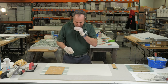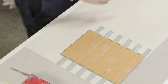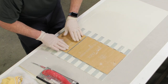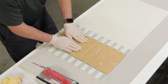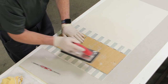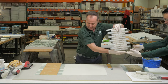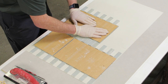Another thing here is you'll see that I set a full sheet. See that I've got about six inches down here. One way to hide sheet lines is to actually offset your tile from the get go. So I used a full sheet and a half sheet. Now what I'm going to do on my next set is reverse that process — set the full sheet down here and the half sheet up here. Because our eyes catch sheet lines, this is going to keep us from having to see those.